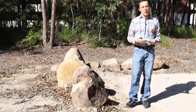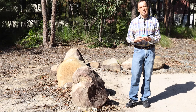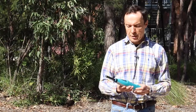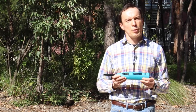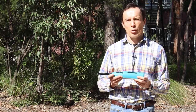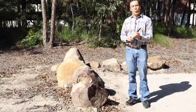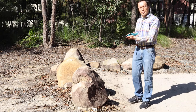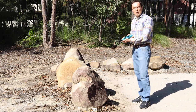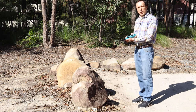To know the strength of rock, what we can do is a very nice and easy test, which is called the Schmidt Hammer Test. This is a Schmidt Hammer device — it's portable, we can bring it anywhere. If we go to the mountain or somewhere else, it's very convenient. The way it works is that we press this device against the rock, and then the device will give us readings, and that will give us some indication of strength.